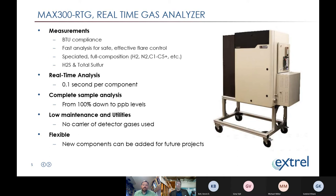In terms of the analyzer itself, it's a typical process analyzer — usually mounted to the wall of an analyzer shelter or installed outdoors under a three-sided sun hood. It is a continuous gas analyzer doing an extractive measurement. In flare, it measures the changing composition of the vent gas: hydrocarbons like methane, ethane, propane, butane, C5+, as well as hydrogen if present, and sulfurs at refineries — similar to a GC, giving a speciated measurement of each component's concentration.